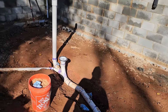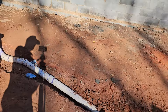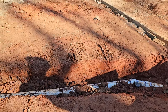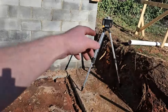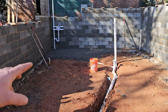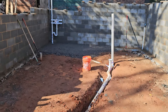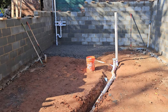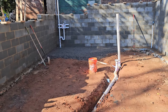We've got the concrete scheduled. As soon as we got our inspection, we went ahead and called that in because it usually takes them about a week to get concrete out to you anyway. But we needed to make sure we had our inspection before we wasted their time on their schedule. We've got our transit set up over here in the corner, and we got the chalk line around the edge — we'll need that for checking the middle. It's looking pretty good right now; I haven't checked it with the level yet, but that's what we're going to do next — just put all this gravel down.